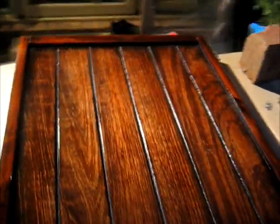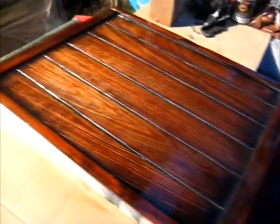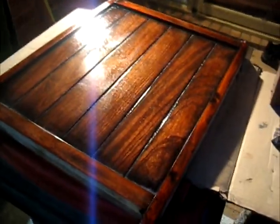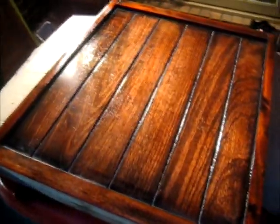It's looking magnificent. Look at that piece of wood now. From something that was that terrible crappy green to the most magnificent piece of wood. Now let's wait about half an hour for that to dry. Make sure there's no dust flying on it. Just leave it without sanding anything further, or you'll end up with dust sticking to it. Get into all those corners there. Really happy with that.